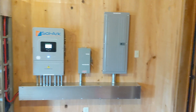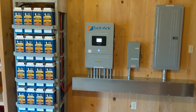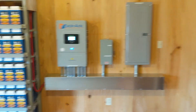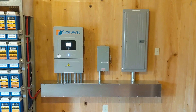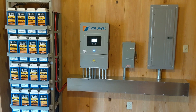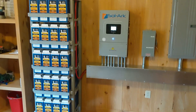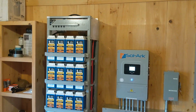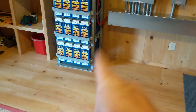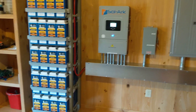Final day. Final testing — making sure everything is set up correctly. We're in limited power to home, meaning we're selling all the renewable energy to the home. We're also running this critical loads panel. We put in our trusty bypass — if there was ever an issue with any of this equipment, we can go back to the grid just as if we were never here. We have the North Star Rack — it's a great space saver. 1,050 amp hour battery. We did have the floor reinforced underneath that — a lot of weight there.